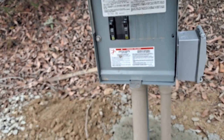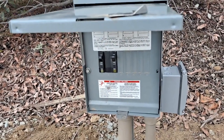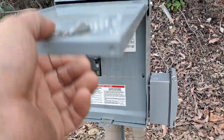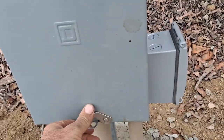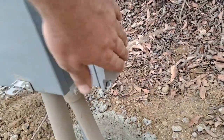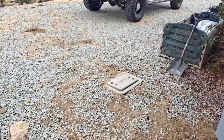So I did 3 total wires, and you can see when I was pulling the wire, I was just kind of trying to knock it out. While I was there, I figured I'd pop in this 20 amp, and I just put an outdoor weather rated GFI here. So if I need power, I got power. I have power fairly close by anyway, but just because I put that one in there, I actually have that GFI outlet left over.